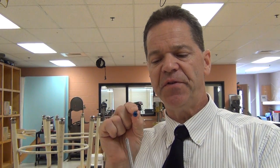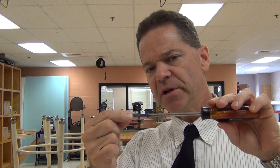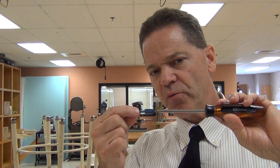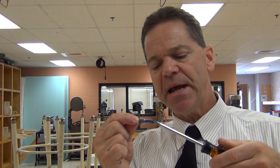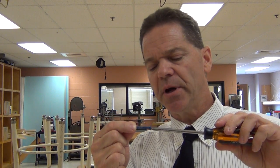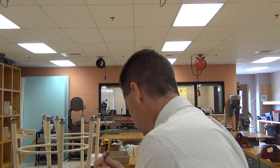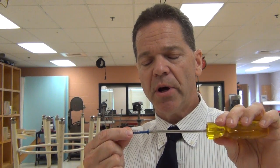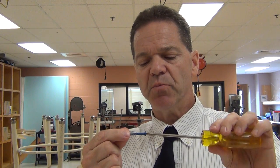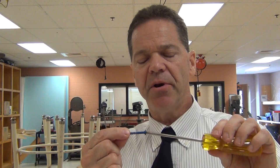The most common is the number two Phillips. Here's an example of a number two Phillips screw — you can see the cross recess. This screwdriver tip fits very neatly into the head of the screw so that as you apply force, the tip bites in and turns the screw, as opposed to slipping out and tearing up the tip or the recess. If the screwdriver doesn't fit properly, it's much more likely to slip and not accomplish your goal of tightening or removing the screw.